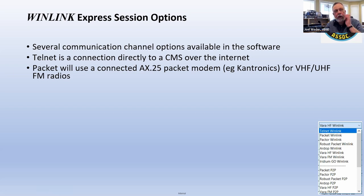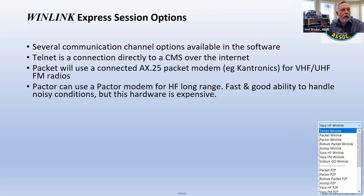Our friends with FARS — Dan St-Pierre, who you might have seen in the heading of this presentation — helped me build it. He's set up a gateway with others in the FARS group up at the CTV tower on 431 MHz, and it's got good coverage. There's another one he's experimenting with at his home in Okotoks, and you need to get to that one through a digipeater at Alderside. At 1200 baud, that's actually better than you're typically going to get on HF. Maybe one day we'll go to 9600 baud modems.